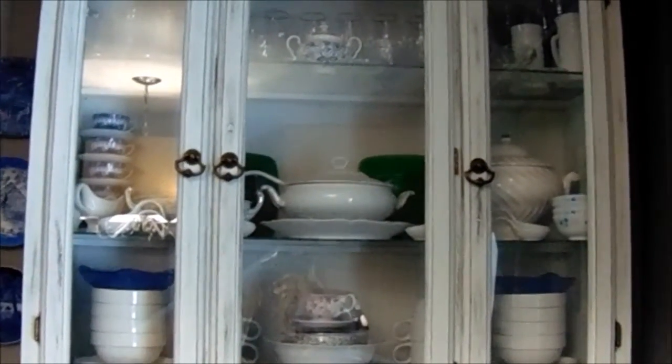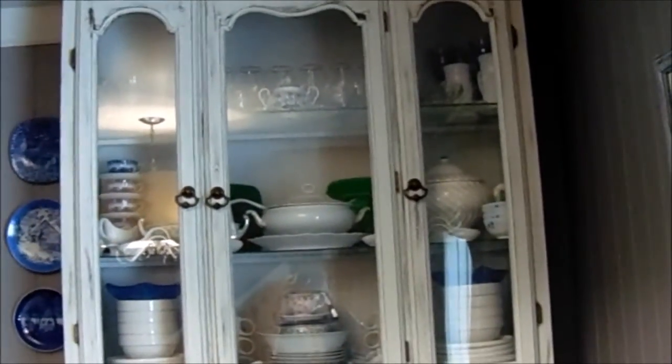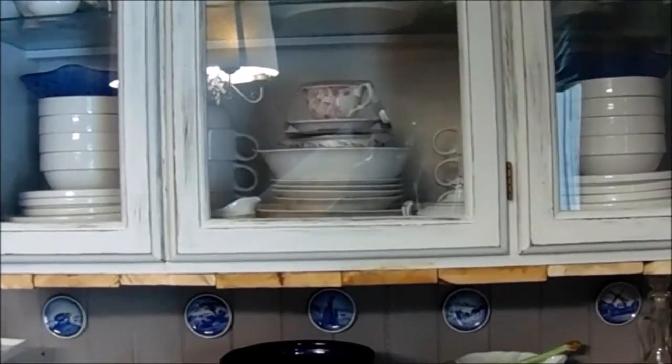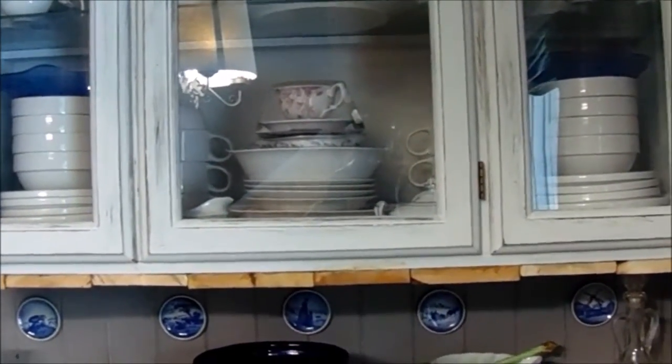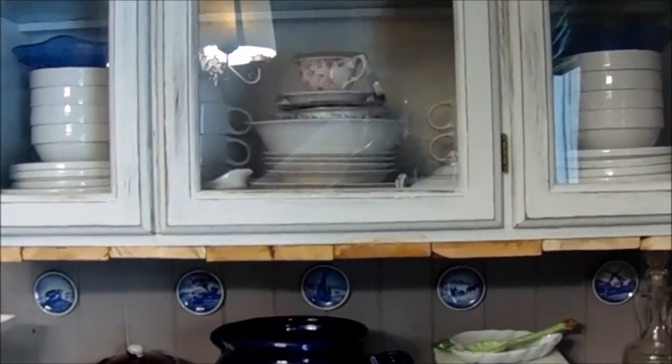Here it is — my made-over cabinet sitting pretty, mounted on the wall in my dining room. I should mention that because the cabinet was a two-piece cabinet, the bottom shelf of the upper portion was actually just the top of the bottom half of the cabinet. So I had to compensate for that by getting some pieces of reclaimed lumber and just gluing and screwing them to the bottom of the cabinet. And there you have it — a unique cabinet for my dining room.